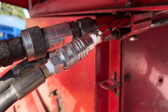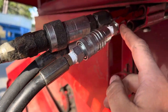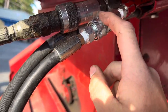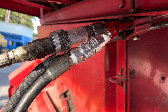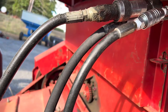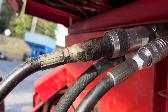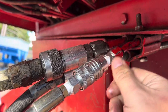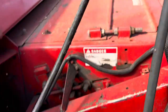I replaced the quick coupler for the reel lift, which is quarter-inch. The only change there is I switched it so the female is on the combine side — that way I can run a dust cap in it when I'm not running soybeans, like for corn. The old male fitting that was on there always leaked. I got all the hydraulic fittings and hoses from Surplus Center. They have a pretty good website, and once you know your JIC 37-degree flare fitting sizes it's really easy to order. You can get flare ends or pipe ends on the hoses, whatever you need.